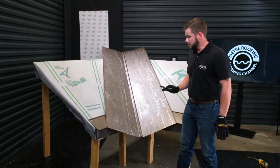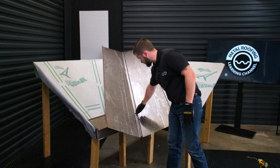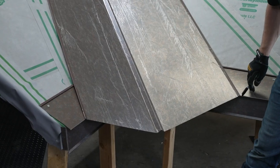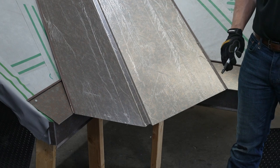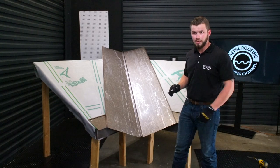So once all that's in place, you're going to have to go underneath the valley pan, trace out where your eave trim comes across and all the way through. It's going to be a little bit hard to get video of that, but I will get going on that. We'll flip it over and show you guys what we came out with.